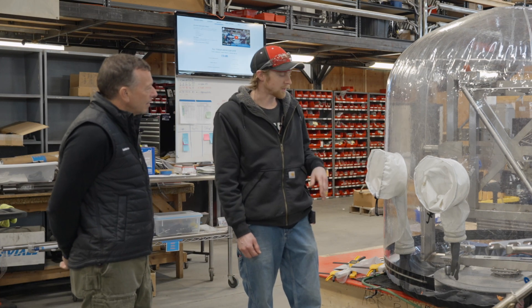You'll notice in some of this original gear we have this cross-bracing. Titanium is a springier metal, and that springiness was dampening against other things like the shocks on the gear and the tire. So we didn't want as much spring in it — some of this bracing was for reinforcement, and some was to limit the amount of spring in the gear. We originally started the design to be very similar to the design of steel gear, and then realized that was not the right approach. There were things done on steel gear that are part of its history, and things that just had to be different because of the way titanium behaves.